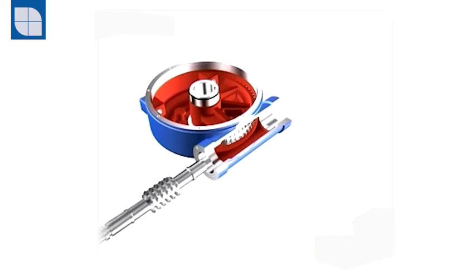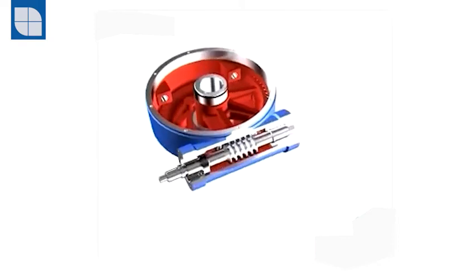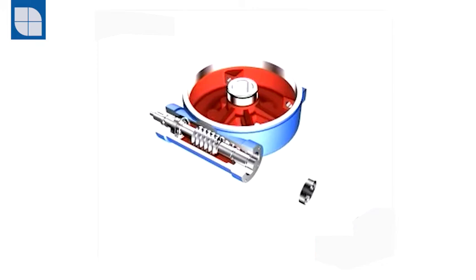This is a key feature, as the failure of large bore butterfly valves is often due to the inferior design and quality of the materials. Precision machined gearing and components ensure zero backlash. Excellent sealing ensures no ingress of water and lifetime lubrication of the gearing. Electric multi-turn actuators can be directly mounted to this gearbox, which has an F10 mounting flange.